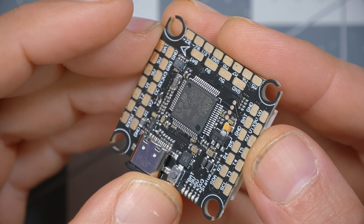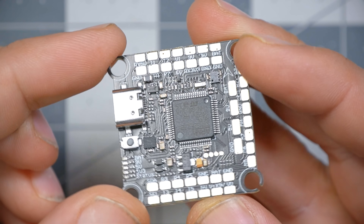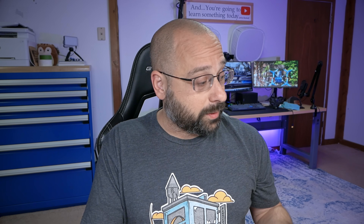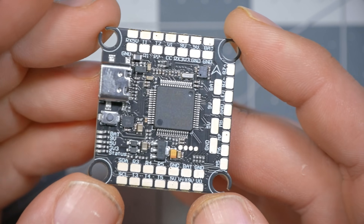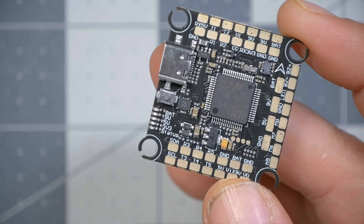The flight controller for this build is still the JBF7, but this time it is the JBF7 V2. We've updated the flight controller to a new version with a few improvements. For example, we finally have a USB-C plug. There are some diagnostic LEDs. It does have a barometer and now it can run iNav if that's what you want. It also has plugs on the bottom to make it easier — if you prefer plugs instead of soldering — to swap the flight controller by just unplugging the peripherals and plugging the new one in. I'm switching to the V2 just because it's the latest and I should probably fly the latest on my own quad.